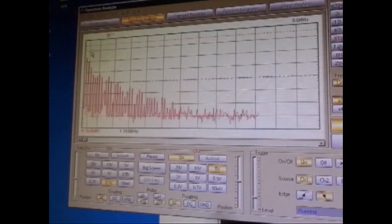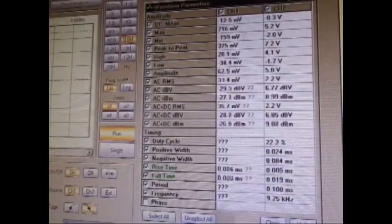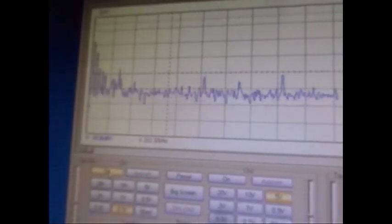It goes up, but it'll start falling off pretty drastically around 295 kilohertz. But it's putting it out here pretty much — 119 kilohertz. That's on there. L1 isn't quite so much. I think L1 is the trigger coil, is what that is.